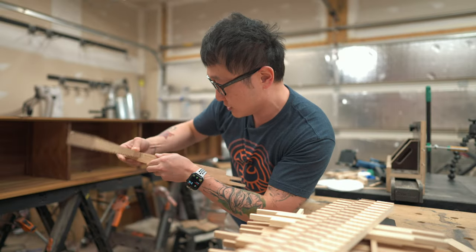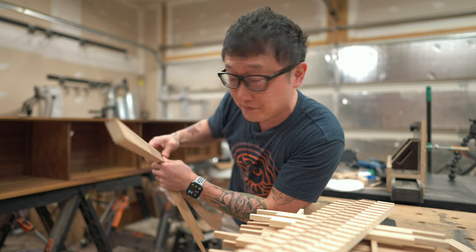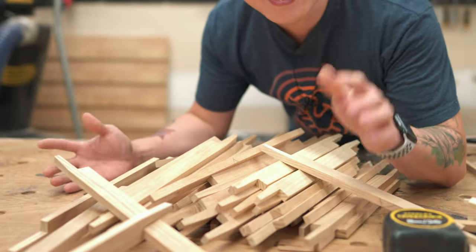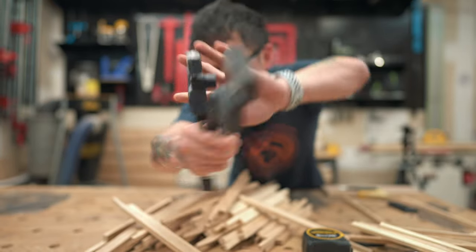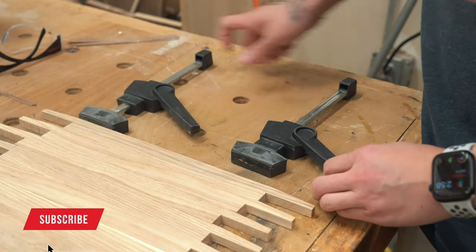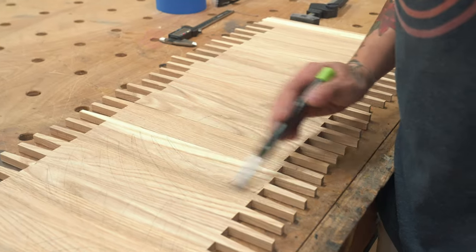Eventually all these parts will come together, but whether I'm working on something large or something small, I always do all the sanding before the glue-up. That way I don't have to deal with corners or, in this case, these tight gaps. We're sanding a bunch of small parts today, and instead of sanding each one individually, we're going to use clamps to squeeze these parts together, which gives me one single large surface to work with. Then just like I would with a larger project, I'm going to use a pencil to lightly mark across the surfaces so I can see which areas I've already sanded and where I still need to do some work.